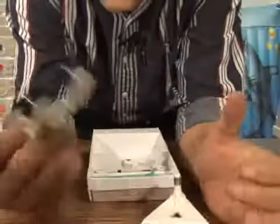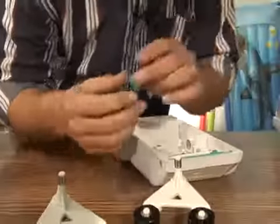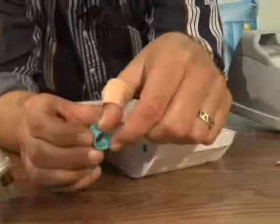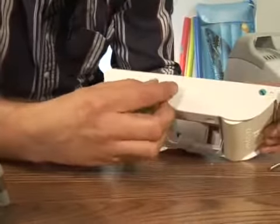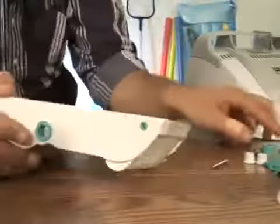So I want to make sure that, again, that these are free spinning. In this case it's new because we're replacing these parts, and we've got some bushing assemblies. First thing you want to do is to put the bushing assembly in. They are flattened on one side, so you know exactly how to put them in. They'll only go in one way, and they will stay protruded a little bit on both sides.